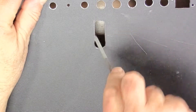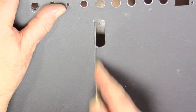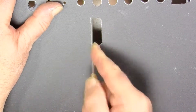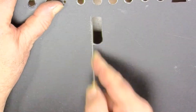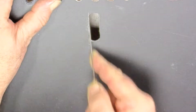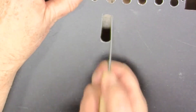Now I've used the larger files, and at this point I'm going to use a small 6-inch flat file. I get more control with these smaller files. Most of the work is already done, most of the material has been removed, and I use these smaller files to do some final shaping. I really do want flat sides left and right, and a little more curved top and bottom.